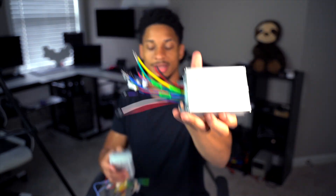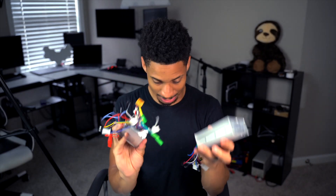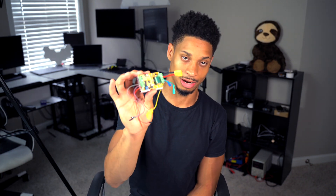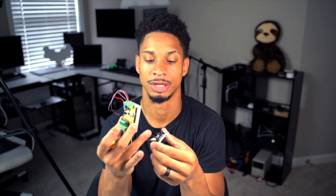We could have used classic e-bike controllers, but they have a crazy amount of wires — too complicated. Instead, I'm going with a driver board, which is way less expensive than those other controllers. Last but not least, the brains tying everything together is our Raspberry Pi Zero W. We'll use one of the PWM GPIO pins to send the speed signal from the microcontroller to the driver board to the hub motor. Best of all, the controller has a 5-volt output we can use to power the Raspberry Pi directly from the 36-volt battery.